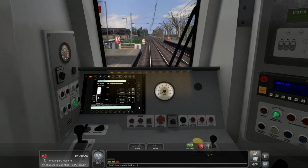And then there's a note at the bottom. If low power is detected, it may be the case in multiple that the VCB has not set in the rear unit. Therefore, attempt to reset the VCB using the switch. This can be checked in the HMI when the train is at a stand.